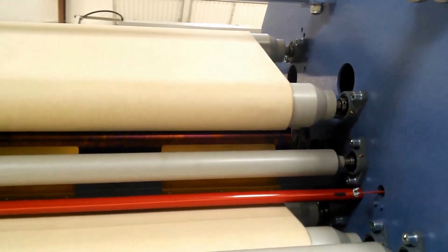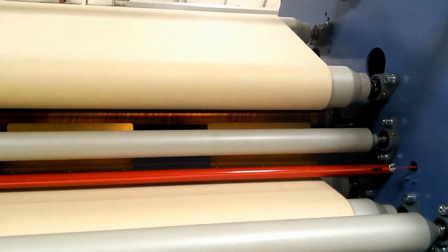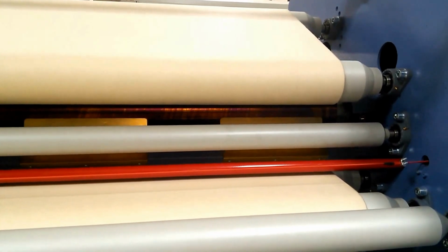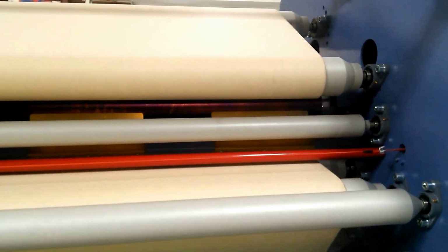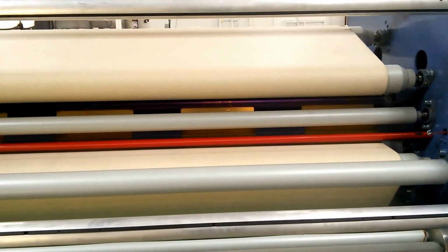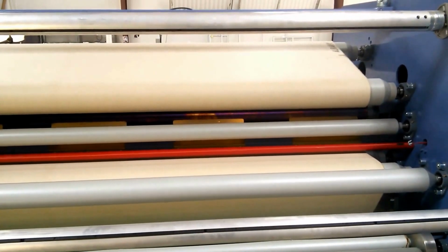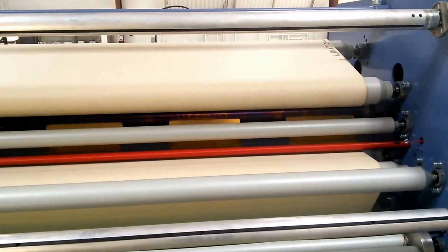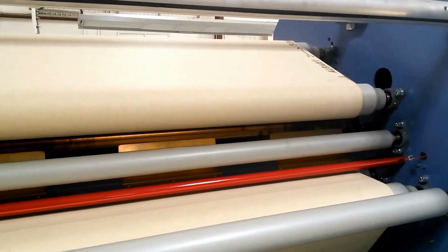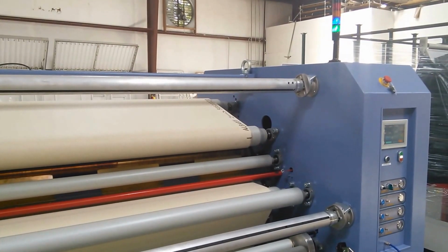But back to the belt reversing and the so what of that, the gist is that when we reverse the belt, of course we have to reverse the belt tracking circuit as well. But in doing so, we maintain belt width and have better belt life, because we're able to run that belt in the reversing mode and it regains its equilibrium, you might say, and lasts longer on the AIT rotary heat presses. This is a 10-foot press that you're looking at here.